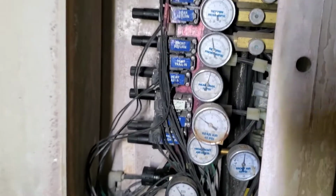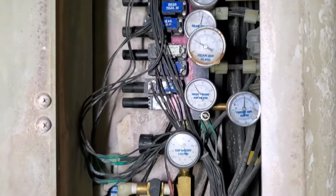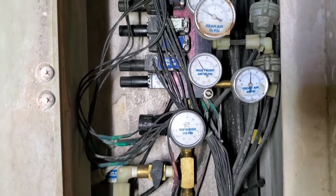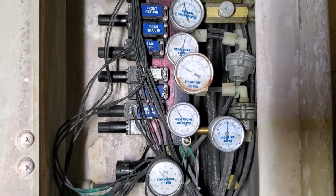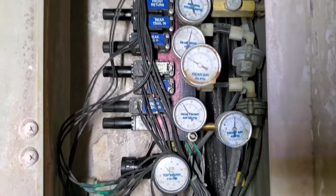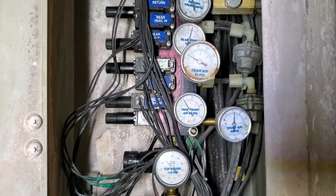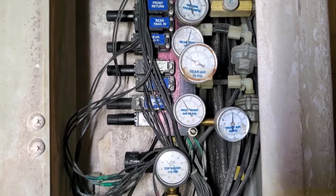For instance, especially the pressure of the brushes going in on the vehicle, you want to keep them around 40 to 45 psi as labeled. Except the high front, because I do trucks with grill guards, shame on me, don't tell anybody. Having less pressure on the front brushes will reduce the chance of me tripping breakers. Plus it'll still wash just fine.